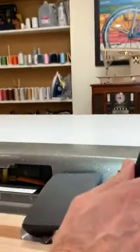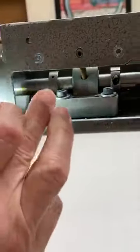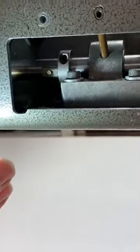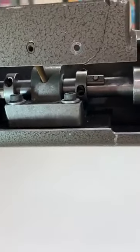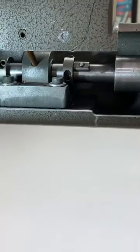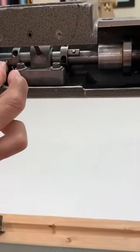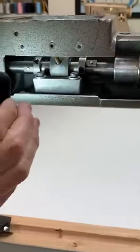So let's go back up to the top and we'll follow the top shaft back down. Our top shaft comes back through the top up here, goes through this bushing, and it comes down. We get to right here and we see this little sensor. This is a little electronic sensor with a magnet on it. There's a printed circuit card which sets up on top of our machine, and a lot of times it has the circuitry in it for our laser and everything, but it has needle positioning sensors in there which pick up on these little sensors, and it lets us know that our needle is in the correct position.